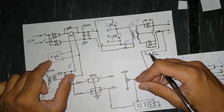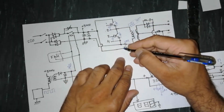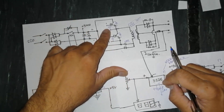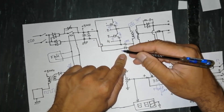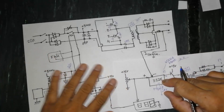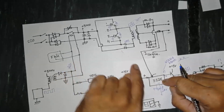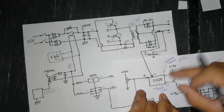There is a temperature sensor connected to the same heatsink where the IGBTs are mounted. If the temperature reaches 90°C, the sensor sends feedback to the IC and the machine turns off — switching stops. The fan continues running to cool the heatsink. When the temperature drops back to 60°C, the machine automatically turns on again through this temperature sensor, providing over-temperature protection.